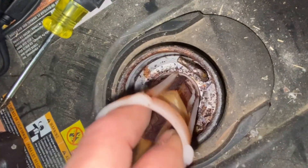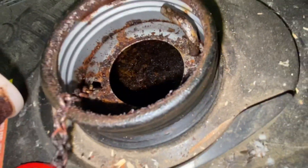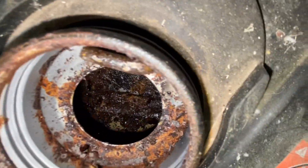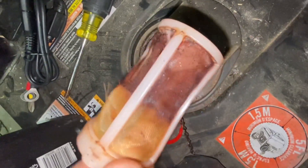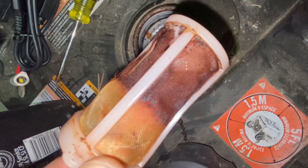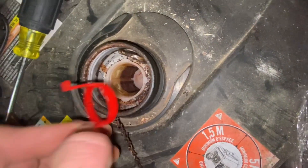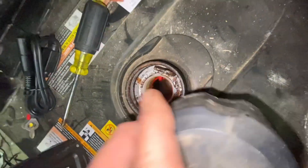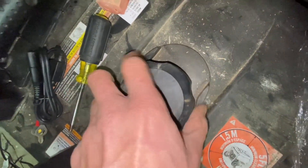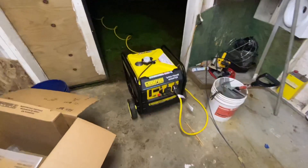When they did that, the ethanol drew water in. Look at the amount of rust in that tank — it was a perfectly good generator and it took me five hours to get it running. You could see the rust level matched the old gas level. They didn't do anything wrong other than put gas in it and leave it. I use Sta-Bil and stuff like that — not a sponsor, I have no sponsors.